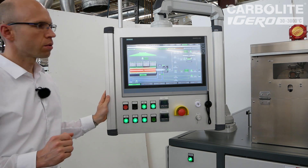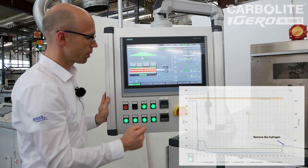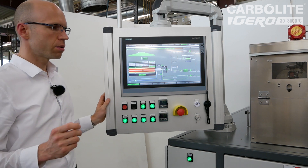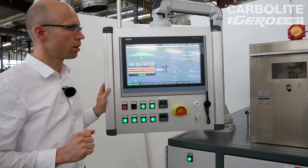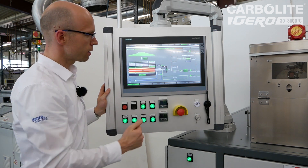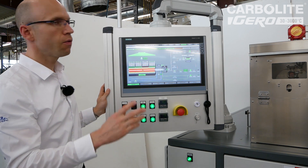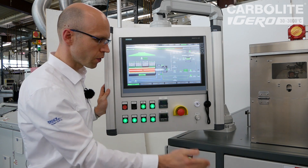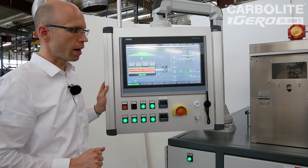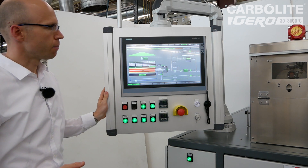You can move your sample from hot to cold and vice versa in full hydrogen. I start the flooding process after the process to ensure there is no hydrogen inside anymore — this flooding takes place in nitrogen only. You have this movement from hot to cold and cold to hot in full hydrogen with manual manipulation of the sample, without any safety restrictions, because this is a safety-rated SPS. Even in case of emergency, leakage of hydrogen or nitrogen, or loss of pressure, the furnace has full safety control for hydrogen operation. There is also a flooding tank here for power failures or other unexpected events.